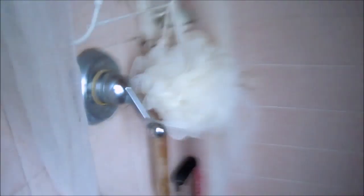We can see we got a little bit of moisture action here — it's actually fairly solid. One of the problems is that we have a shower right behind, so there is a possibility that this valve could be leaking underneath. And we've got major, major water damage downstairs — that's what's happening.